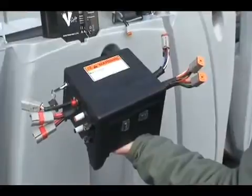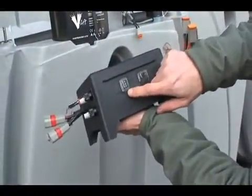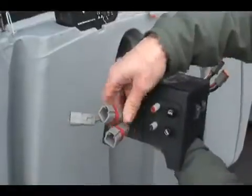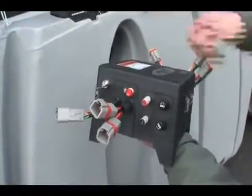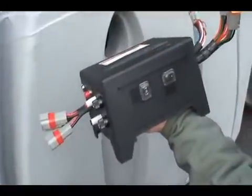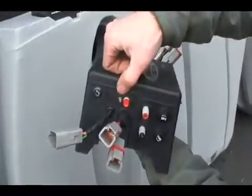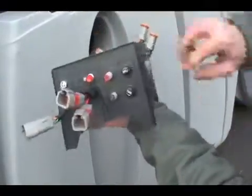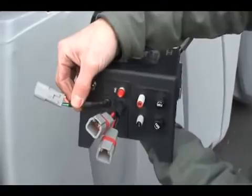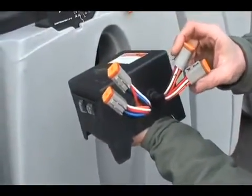This is the remote control unit with the serial number labeled on the top, off and on switches, and an up and down rocker switch on the front. On one end are the plugs for the batteries marked with the red band. There is a key switch to enable and disable the rocker switch, a program button for the key fob transmitter, an indicator light for low battery, plugs for an LED accessory, and a cord for a communication cable used with the VL11. On the opposite side are four leads that go to each of the four tanks.